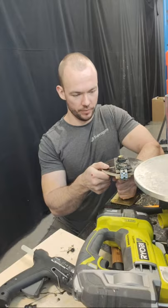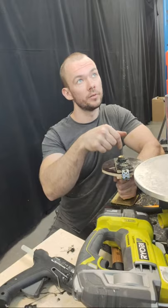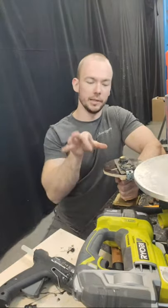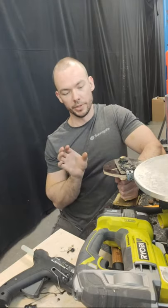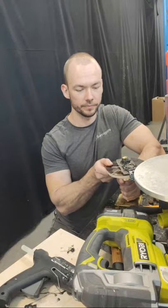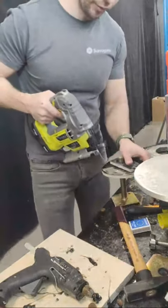So what is an option? Another option is make the hole bigger, the recess bigger, so it turns all the way out. It's not working the way that I would want, where you'd give a selected amount of volume and then turn that volume out. But if you made the pocket big enough, there'd be nothing to jam on because there's always a pocket allowing for more food to build up into. And then when you rotate back, you're kind of forcing it back up. But it might be less force needed than crushing the pellets. So I'm just going to try to cut this bigger. Let's see if that will actually solve it for us. And then we can move on to the servo programming.